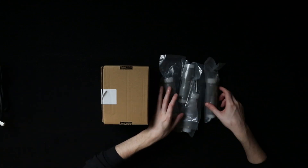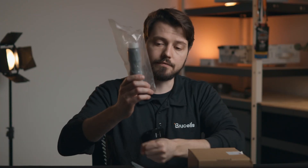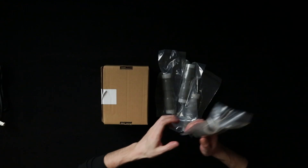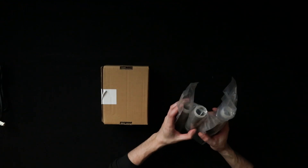Next, we have a couple of shrink tubes. These will help you weatherproof your unit — they'll just attach to the ports after you've got your antenna up in there. You can just shrink this down onto it and make sure that no moisture can get up into your antenna and ruin your day on that end.